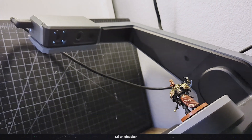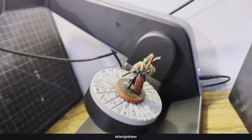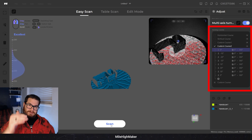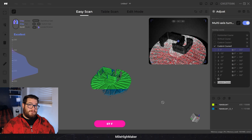I've gotten down to 40 and 45 is the max, but then you start actually losing model tracking, so I usually keep it at 40 max. If I have a larger model with more detail I'll go to 45 so I can shoot up at the base a little bit. I usually set it every 10 degrees from 30 all the way down to negative 30 - so negative 30, negative 20, negative 10, 0, 10, 20, 30 - and that gives me a lot of information to work with.